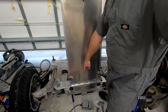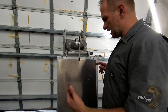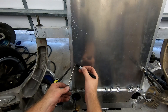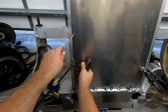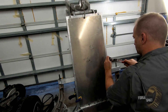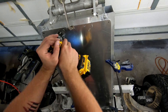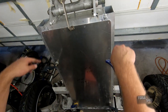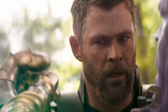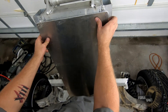Now that we have those all spot welded up, we're going to make even spacing for some holes, drill them out, tap them, and then bolt this all down. We're going to take these dividers and measure out 5.875 inches. Through the power of video editing — we got it all tapped. I'm just going to put it on here so we can start working on our electronics.